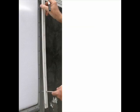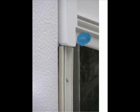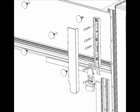Here we're taking the 2 vertical faceplates and getting them lined up and in place, and we're marking them off. This cut needs to take place, but you want to make sure that you can see that the bottom of the termination block is in line with the top of the vertical faceplate. It cannot sit on top of the termination block. It has to be right underneath it. Here's an exploded view showing you what that all looked like.